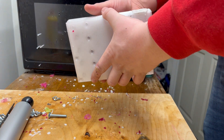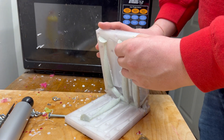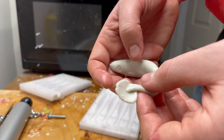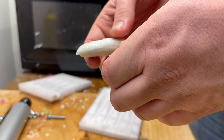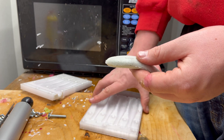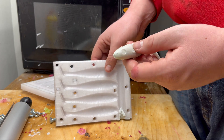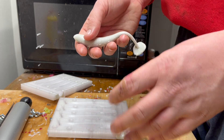Alright, this should be cooled off now. Not bad at all — let me clean these up. These came out almost perfect. There is one little teeny dent in the tail; I'm pretty sure that's from when I slipped with the injector. I have injected this mold before with no dents. We're going to put eyes on them. There is some flashing on here — I think that's because I shot this mold really hot and it warped a little bit — but that shouldn't happen to you guys. I'm not going to print another one, I've printed enough.